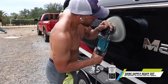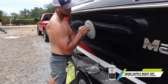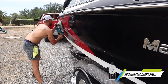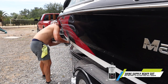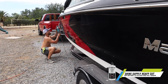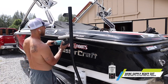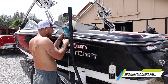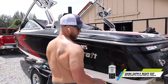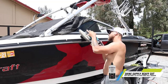On this machine with this type of gel coat, wakeboard boats are a little different than most boats - they have really good hard gel coat, so you really want to run your machine a little slower than you normally would on bay liners, houseboats, or anything like that. Most of my machine work with the heavy cut was right around 900 to about 1000 RPMs. The heavy cut did a great job at removing the oxidation on the back and getting rid of all of those watermarks. I decided not to do the chemical treatment - I was just going to cut them all off anyway. We did a really nice heavy cut on the entire exterior to get off minor scratches, all those nasty watermarks, and the oxidation, and then after that we moved on to step two.